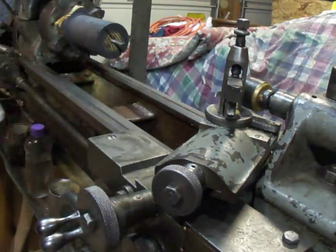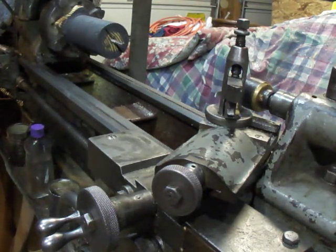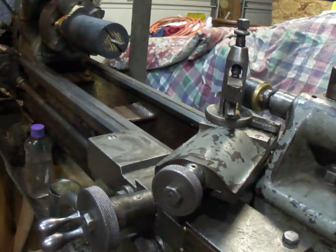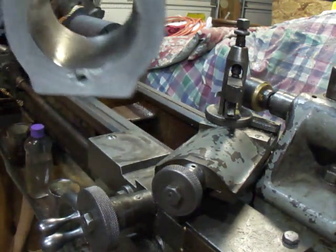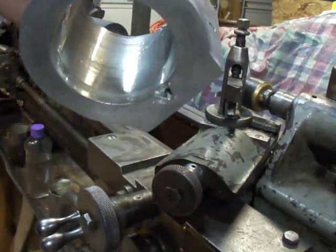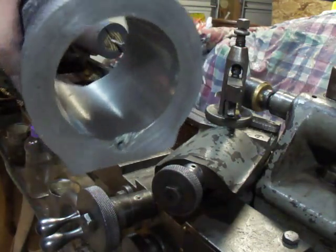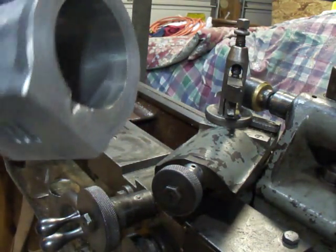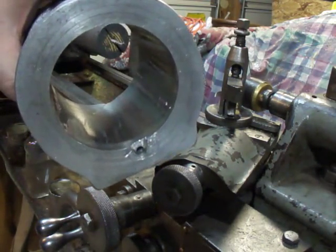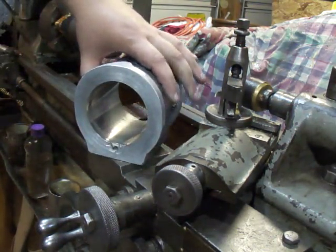I'm done. For the last part I just kept adding the mineral oil — baby oil — because as it was breaking down it was just getting finer and finer grit. Still got some scratches in it, but you can see how polished the bore is now. The thing worked perfect. I put some oil in there so I could just put the piston rings right in. I was going to go with the cast iron ones, but I think I'm going to go with Teflon — I got some Teflon tubing I could use for piston rings.